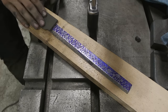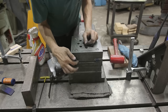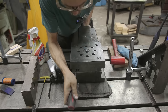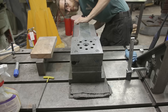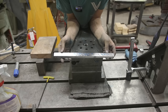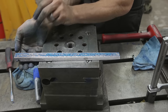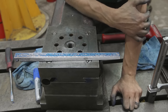With the cross-hatch pattern done we can get this stoned and ready to slide back in and see how we're looking. I'm going to use a screwdriver to hold this in while we slide back and forth to get a more accurate print — not the proper way to do it; ideally you'd install the gib screws front and back and set the tension properly — but the concept worked, just a little more cumbersome. Let's get that gib tapped out and see how we're looking. Remember, smearing is a lot more common on gibs. Honestly I'm really satisfied with that — the print is a little heavy but we have good coverage all the way down. We do have a slight hollow on one end, but this is going to work really nice and we're going to roll with it.